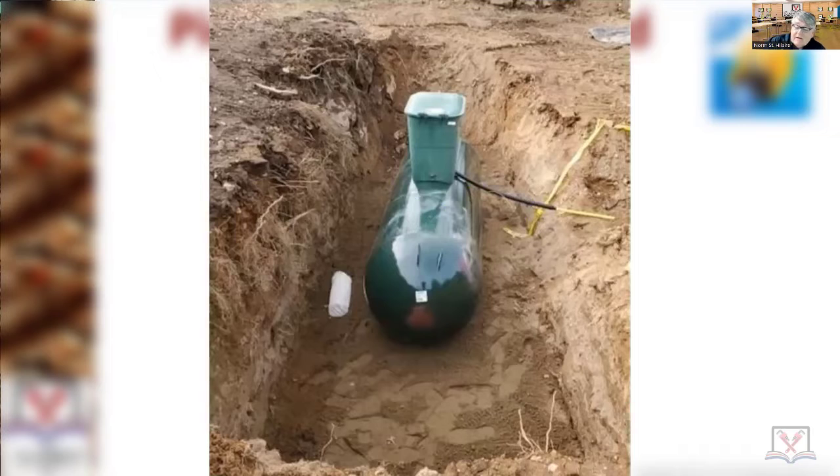Very good — congratulations. Now, all of you are sitting in tier two and we're talking about propane, introducing it to you for the first time. A lot of you think you don't have anything to do with it because propane companies typically will exclusively do some of this stuff — and you're right to an extent. A propane company is going to set the tank, but there are going to be questions about what size this tank is, how far it should be from a dwelling, how far from an opening. And this pipe or tubing — from the connections through this tubing — that is your responsibility as well, even though you might not do it.